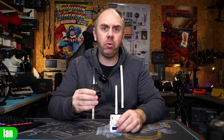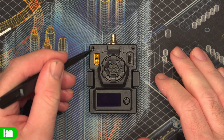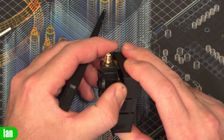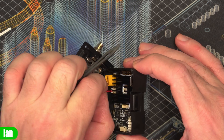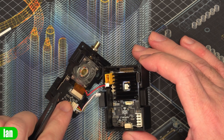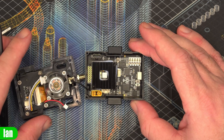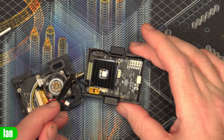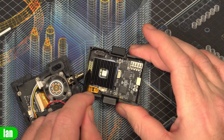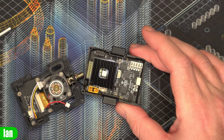The next thing we're going to do is take this new module apart and have a closer look at the PCB and how it differs from the original 500 milliwatt one. To take a look inside, you need to remove the two screws in the top corner, gently release the front panel, undo the cable for the front board and the fan, and that releases the inside. It's worth mentioning that once you've undone those cables the antenna one will stay connected via UFL and to remove it you need to remove the board from the case.